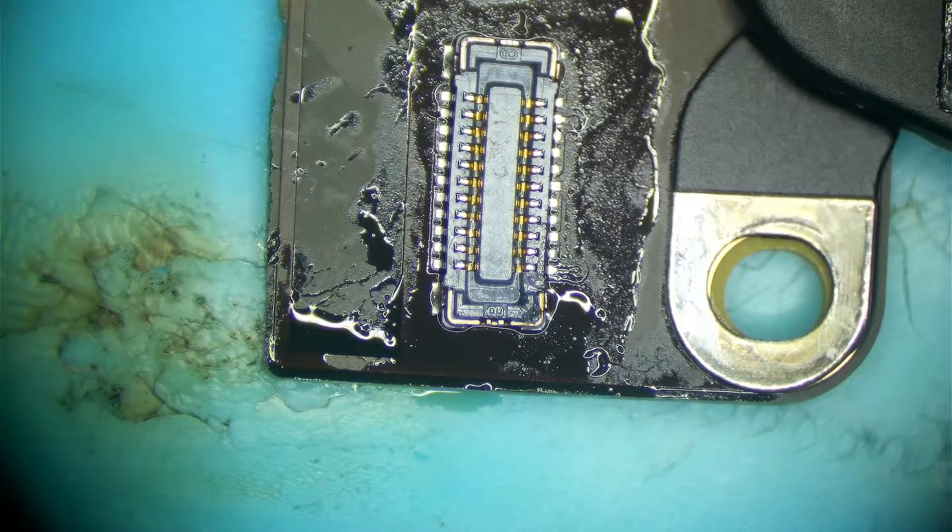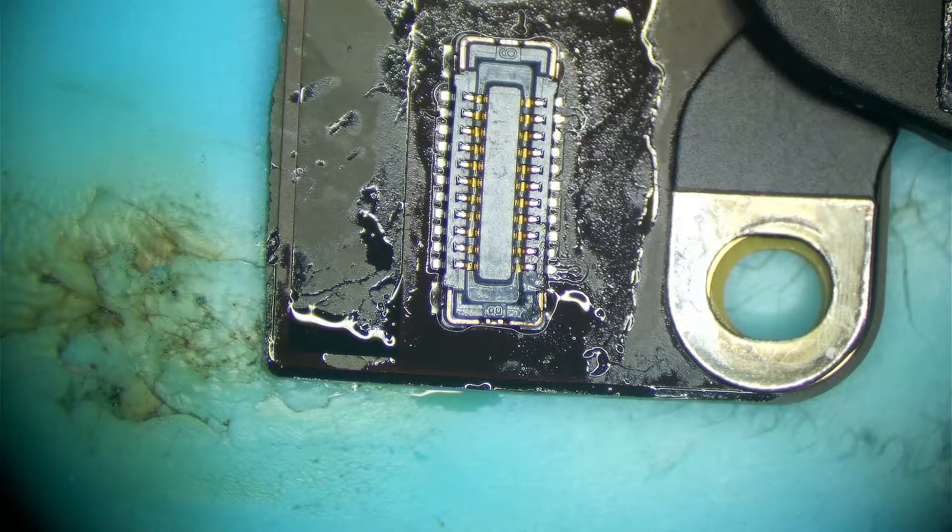Now it's time to test in the enclosure. In the enclosure you can see the connector there is corroded, but it's not bad. I'm just going to Q-tip with alcohol and then it should be fine. That looks superficial in nature so I think we'll be okay.